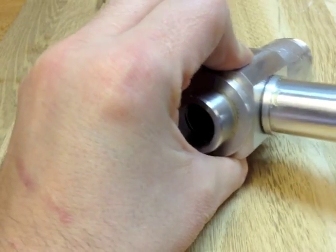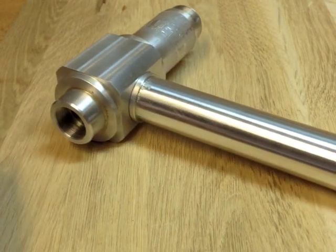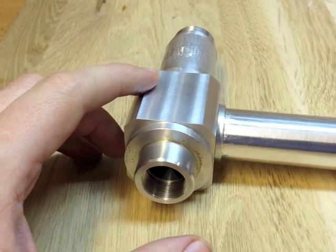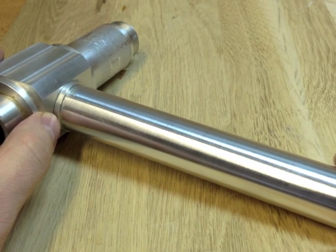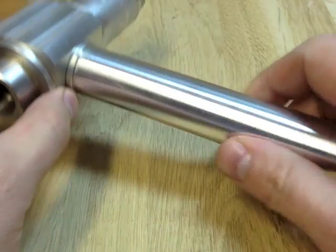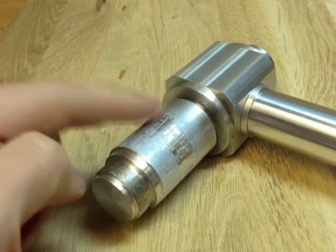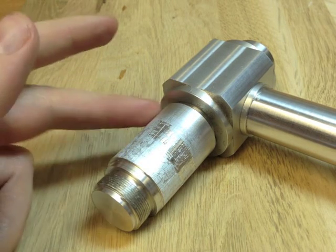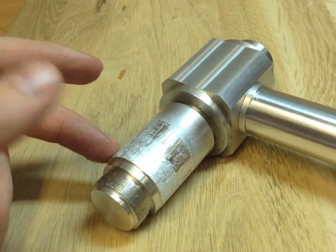That's all made of aluminium and will be anodised black eventually. What we have is the body, machined out of a solid aluminium bar. The eyepiece tube will have a focusing lens at the eye end. Ultimately, some sort of interchangeable shank so that a morse taper could be mounted on there, or some other shank to suit the machine being used.